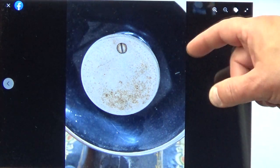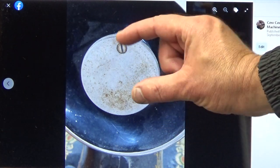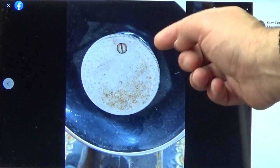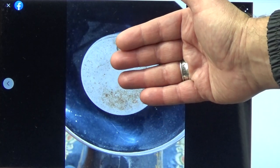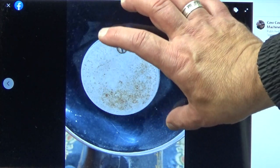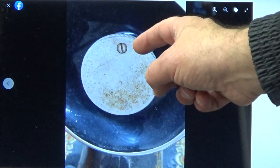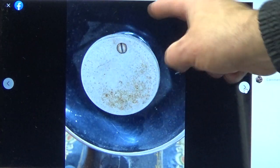And again, like I talked about recently in one of the premieres, on the other side of this stop action there's a little metal ring, and you always make sure that those little prongs, there's a prong on either side that engages with the main shaft, are pointing out towards you when it's put on. Because when you turn this stop action, it compresses those prongs and pushes them into the main shaft, which allows the needle to move. When you turn it the other way, it releases those prongs, and then all that you turn is the balance wheel.